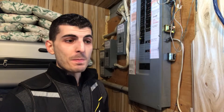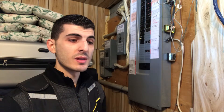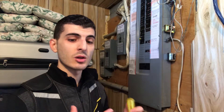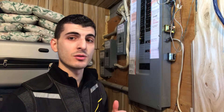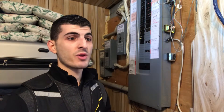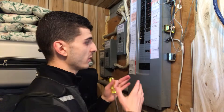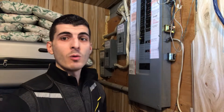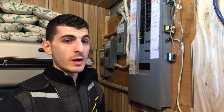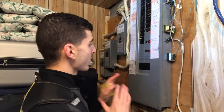Unsealed entry points can allow mice and rodents to get into the panel and short-circuit a breaker, causing a fire. A lot of times we see distribution panels installed in closets, pantries, staircases, or washrooms — these are places you should not have distribution panels, either because of restricted access or because of the presence of a water source nearby. For example, panels in pantries right beside a water heater: if the water heater develops a leak, it's near energized electrical components, which is something we do not want to see.